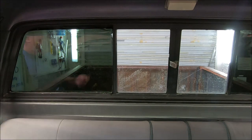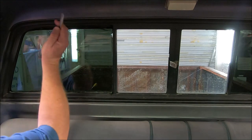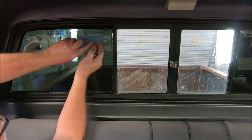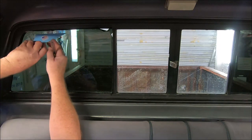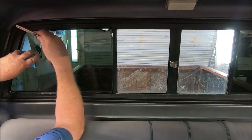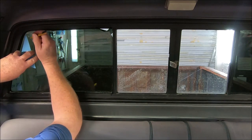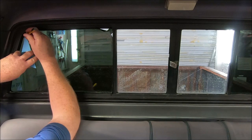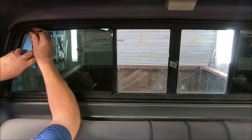Now I'm going to take my blue frog and my knife with a 30-degree blade. I'm going to snap a new edge. This may look odd — I'm usually up in the truck doing this, but I'm going to do this from here so you guys can see. I take this frog and ease it up; I don't cause a big commotion. I run my blade out three clicks. I take the tip of the blue frog and follow the tip with this knife ever so easily so I can get my final trim on the inside.